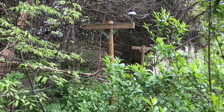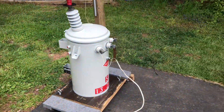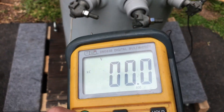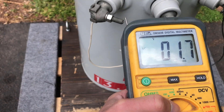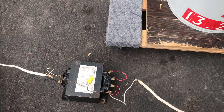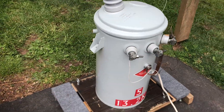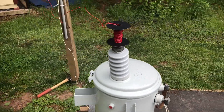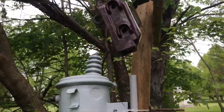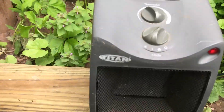Let's measure the voltage drop. The space heater is on back there on full power, pulling about 8 amps at 120 volts. To measure the incoming line voltage — it's 110. Keep in mind that the biggest loss is that 1 kVA transformer. So from 110 volts it gets stepped up to 7,620, comes in through the cutout fuse, and into the 7,620-volt transformer.